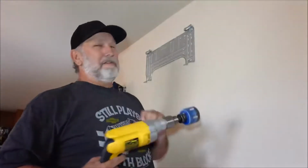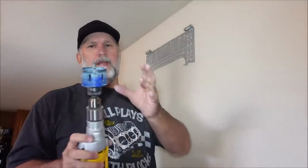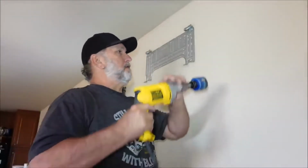Okay, now's the time we got to cut into the hole. This is the scary part for anybody. Now get a good quality hole saw for it, whether it be the 2.5 inch or the 3.5. I'll put a link in the description for the ones that I use. They seem to do really well.